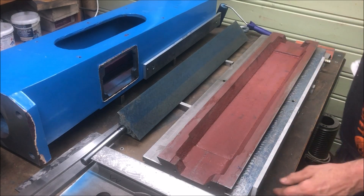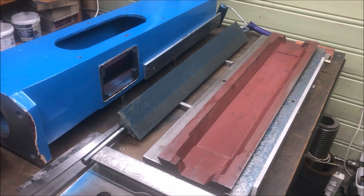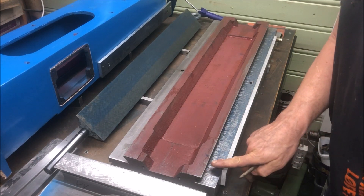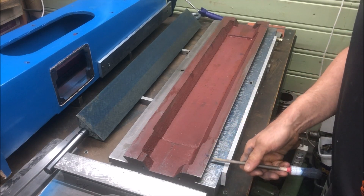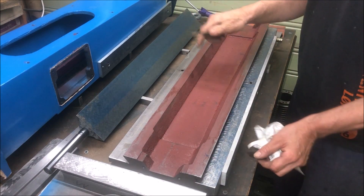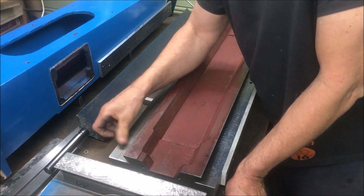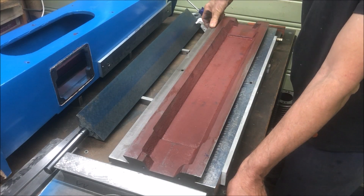I've already just played around with the scraping of the table here. If you look at the table you'll see it's very early — just one cross scrape there and one there, which I marked up — but I can at least see that it almost covers, and that tells me that even though the surface here is kind of rough with milling marks, it's okay in terms of flatness.